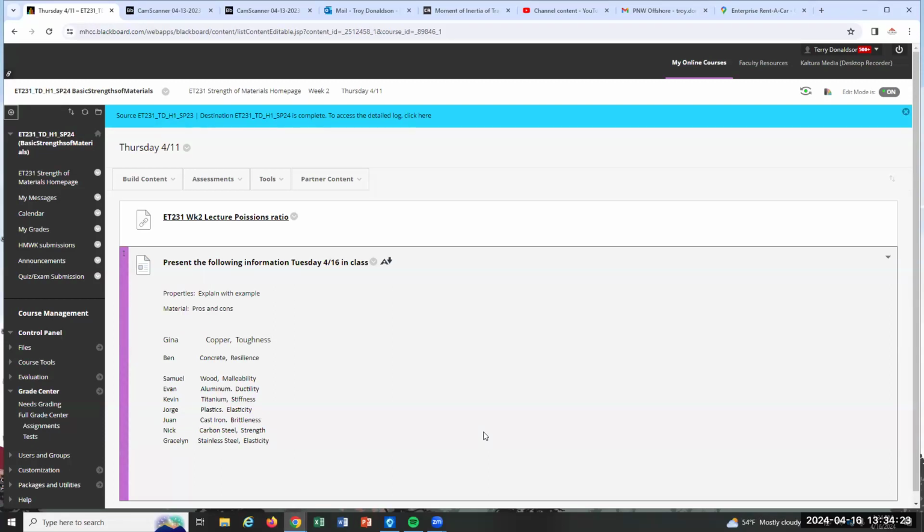Yep. Good. It's a good heat conductor, and it's corrosion resistant, meaning that it can withstand groundwater and the presence of salt and acidic particles. So absolutely, it goes along with biofouling resistance, which is the accumulation of microorganisms like algae and small microorganisms on wet surfaces that can cause structural deformities. And it has good machinability, which is just, it requires little power to cut it. Yep, that's exactly right. And it produces a smooth finish that minimizes wear on other tools. And it's not magnetic.